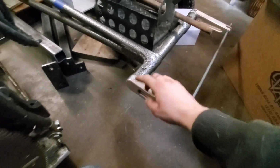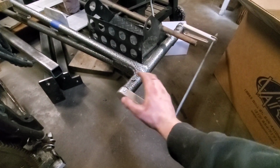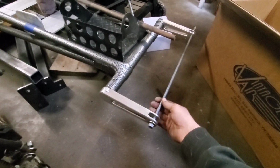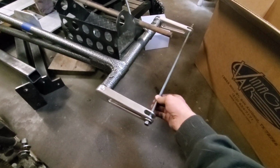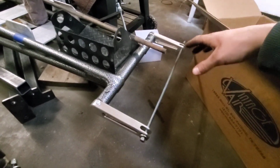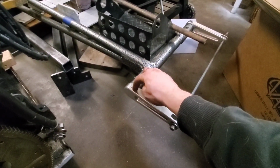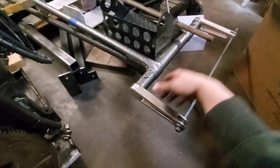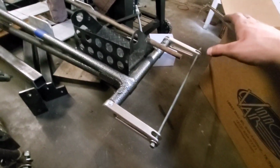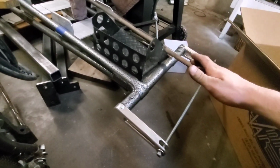There was this hole that held this bolt for this idler arm. It was wallered out, and so this arm was able to move up and down. Therefore, it would throw the alignment and stuff like that off. So I took some threaded rod and stuck it through the holes that hold the axle, and stuck a level on this, made sure everything else was level, and we welded half moon shapes on those holes, and then re-drilled it. That way we could get this perfectly in line with the other one and make this perfectly level up here. So we did get that done, which was one of the other main concerns besides the slip joints. But other than that, there's still a lot of work to do on this car.